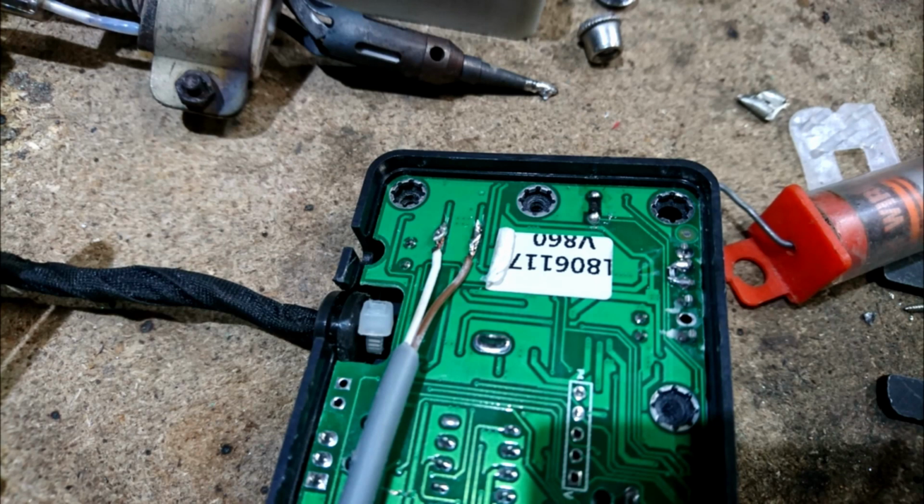So this is what it looks like on the inside, and I remember reading on Henk's post, actually he found this one a bit easier than the old style one, and you can see he's tagged straight onto the back of the printed circuit there. You only need a single channel controller, because it's one button. So if you've got this style, take a good look at the picture there, look at the 2 tracks you need to tag onto, and you can solder straight onto the back of that.